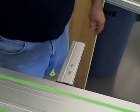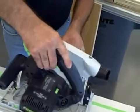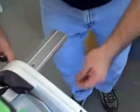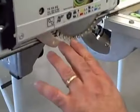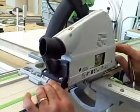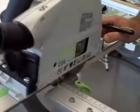And then I'm going to take this saw. What I like about this saw — I can lock it right in. I'm going to take a pen or a pencil. I always like to make sure I'm using the same tooth. So I'm going to mark that tooth so I use the exact same one every time. I put a little X right there. So I'm going to slide that in, and when X hits that mark — which it is — I know it's dead on to that mark.